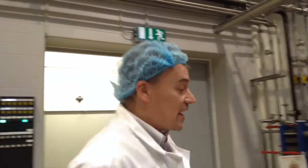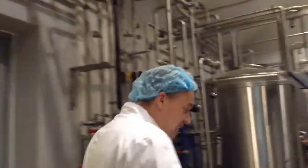We use 3 waters as most distillers. We do work with a bit of a different temperature schedule to get more of the volatile congeners out. And that's also why we don't want to have a too thick bed, because we need to aerate it to get those aldehydes out. Of course, after mashing, we get the sugar solution over to fermentation.